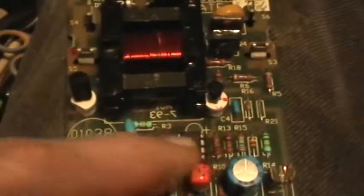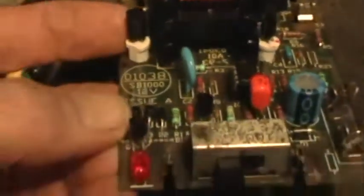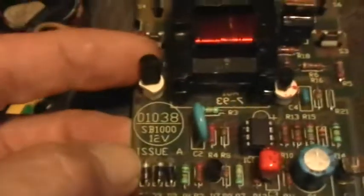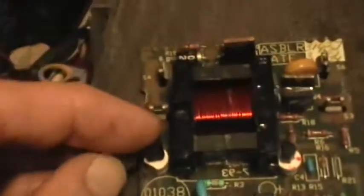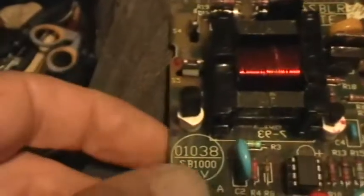As you can see, I've put a couple of transistor sockets in there. This transistor was missing — the original fault actually seems to have vaporized this transistor, so I'm just guessing at the value of that one.